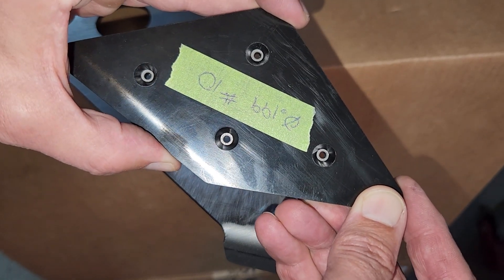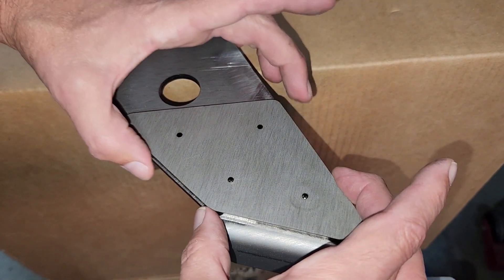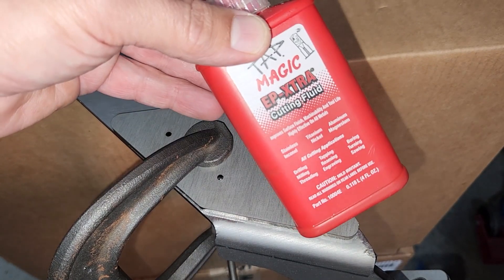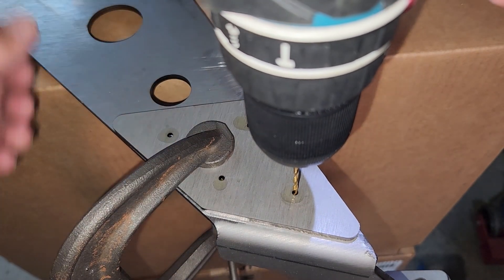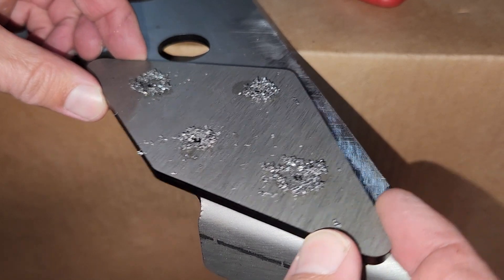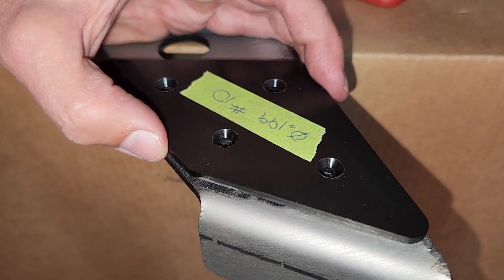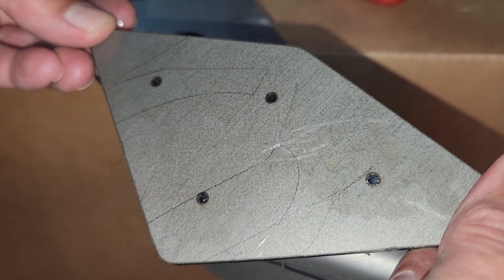Let's double-check my holes — I mean, it's from CAD, so it should be perfect, right? Looks great right there. So there's our drill template. I'm going to go ahead and clamp it down — totally clamped down, that ain't going nowhere. I'd recommend adding some cutting fluid in each hole, and with your hand drill, just slowly cut through that base material. One done. Four done. Let's check our work — they are all perfectly located. I can just flip it over and do the other side.